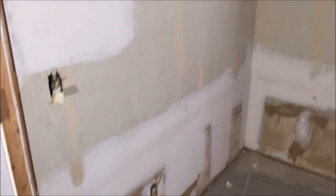This can also happen during wallpaper removal — there's definitely potential to peel up the drywall paper. On this project, they did not seal the raw drywall below where a chair rail was, and when the homeowners removed the wallpaper it just tore up the drywall. So what I'm going to do is peel off some of the remaining wallpaper and then hit it with a special primer before I do any mud work as well.